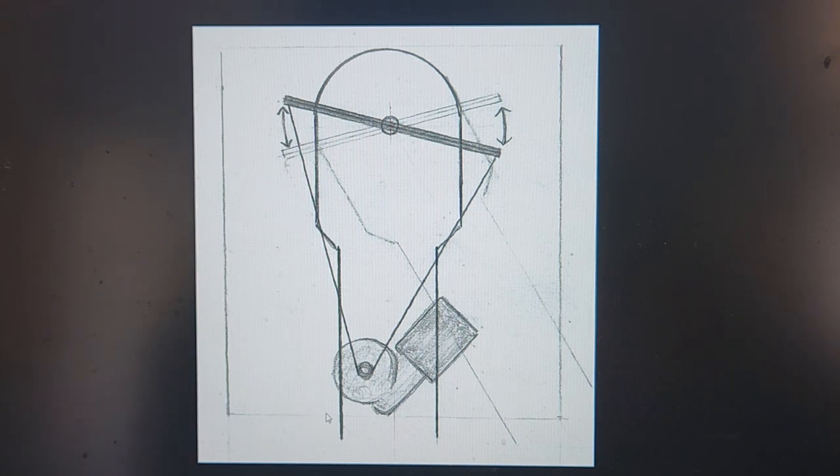This was based on the idea of a boat steering cable drive. When you have a boat with a 100-horsepower outboard motor and a steering wheel with a spool, it has a cable going off in two different directions. As you rotate the spool, you're drawing in on one cable and letting out on the other. This is an amazing mechanism — a very small spool has incredible power over the business end. That's how a 90-pound child can control a 100-horsepower outboard rather than the motor overpowering the person at the helm.